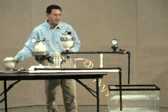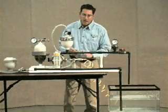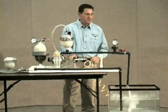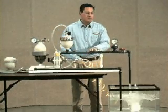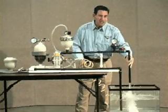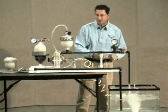For this test, I'm going to overcharge the dampener, which turns it off. When I turn the pump on, you'll see the pipe shaking, vibrating, and a pulsating flow. This flow is the pump by itself without the dampener. Pipe vibrating, pulsating flow that is foaming and splashing the product.